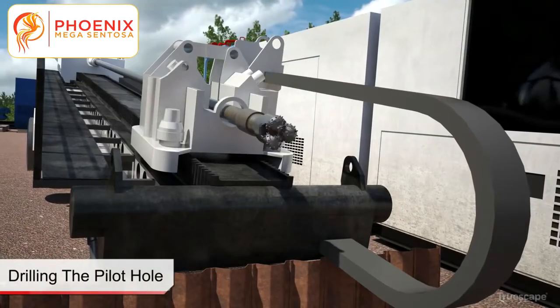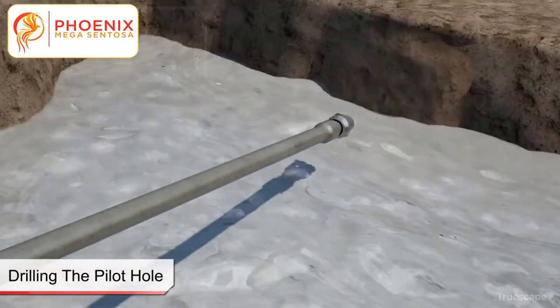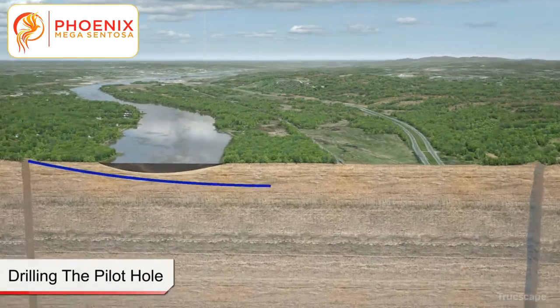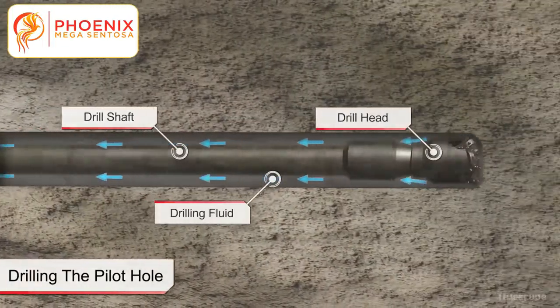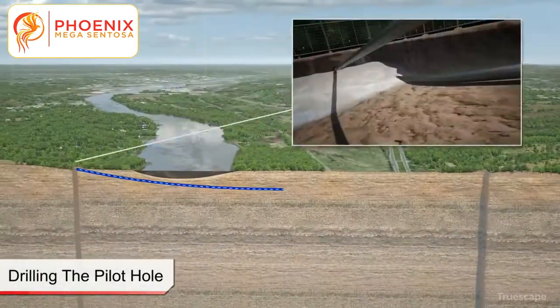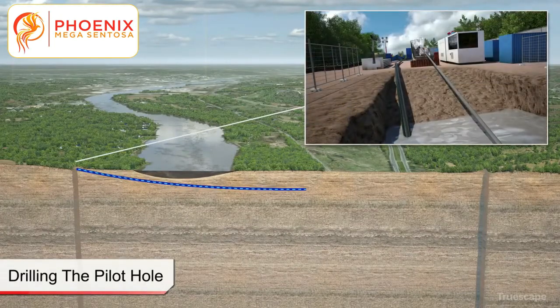This cabin houses the controls used to control the drill rig and track the drill bit location. Drilling of the pilot bore commences by pushing and rotating drill pipe connected to the drill bit along a predetermined path from the drill rig entry location towards the exit side located on the far side of the crossing. A mixture of water and bentonite clay, referred to as drilling fluids, is continuously pumped through the drill pipe to the cutting tools where it mixes with the soil or bedrock cuttings. This mixture flows back to the drill rig location carrying the entrained cuttings where it is transferred to a separation plant to remove the cuttings and recycle the fluid component for reuse down hole.